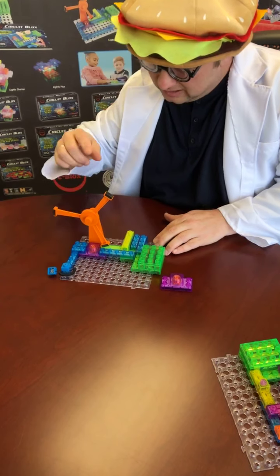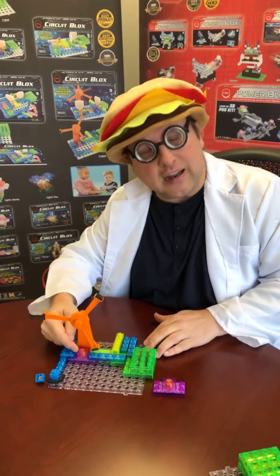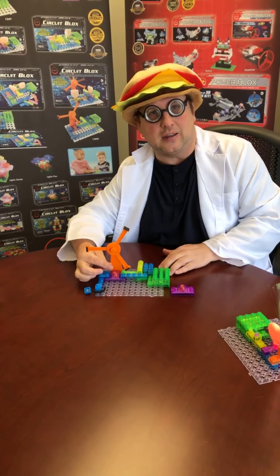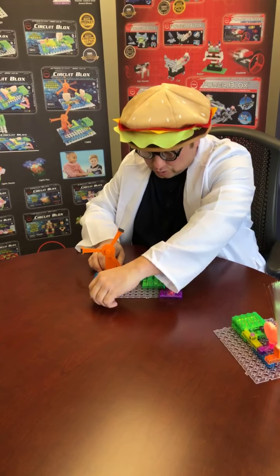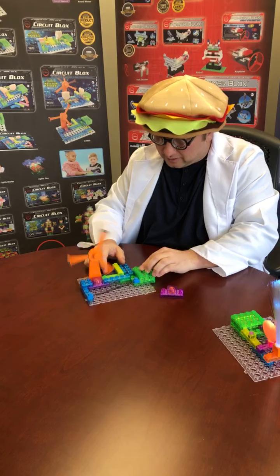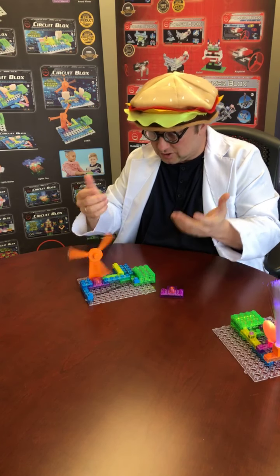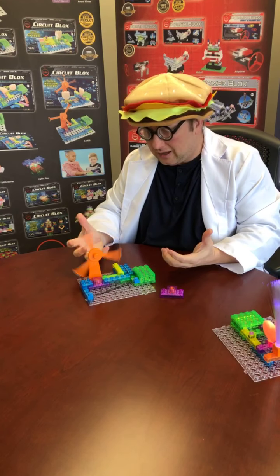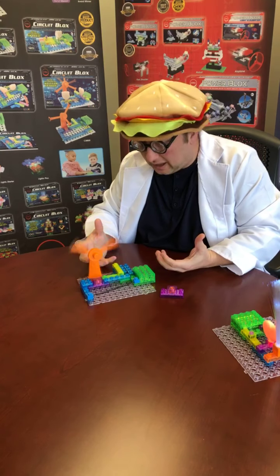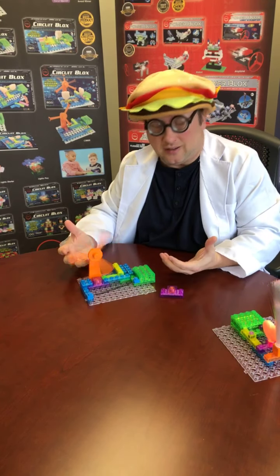So this allows us to turn on the transistor and the magnetic field only once the magnet gets down to the bottom and needs that kick. And so that's why we have that whole circuit with the magnet and with the reed switch and the transistor in there, and that's how it just keeps going. It's a pretty complicated circuit, but it's kind of cool to see how all these devices work together and how this thing is spinning without any motors, just electromagnetism.